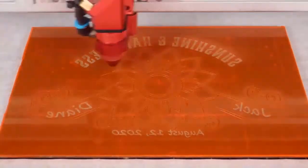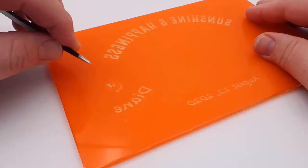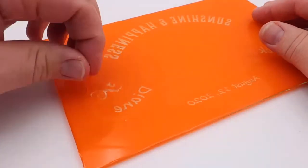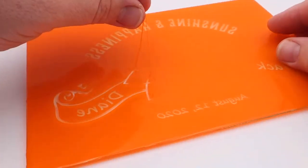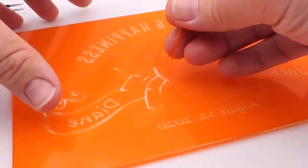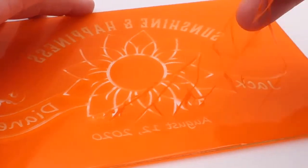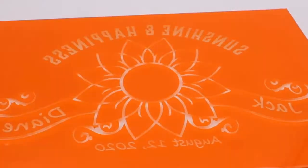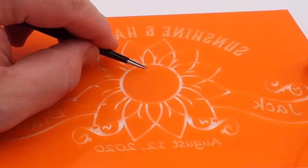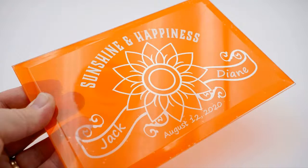Once it is finished and we have our finished result, we then just take a pair of tweezers and get in underneath that one spot. In this case, I've got 2 single pulls, and so I don't have lots of individual details, which is not recommended. I would engrave those details away. And then I just give it a yank. When I yank that away, as you can see, because of the stretchy nature of the Blazer Orange laser mask, it comes right off. And there's a second little circle on the inside, and we have now finished that result.